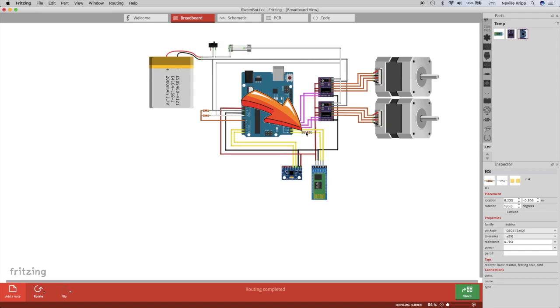Note that there's a resistor in the transmit line from the Bluetooth module. This provides isolation because the USB interface on the Uno uses the same transmit and receive pins, so when you plug in the programming port there's potential for the Bluetooth module to also act on the receive pin. The resistor lets us program the device and monitor on the serial port if needed. We'll also likely pass some information back to the app — maybe battery voltage and some debugging data from the gyro and accelerometer.